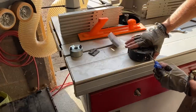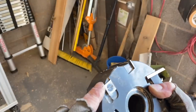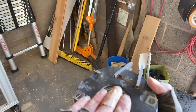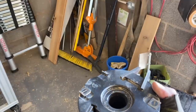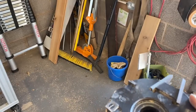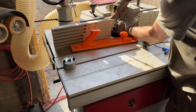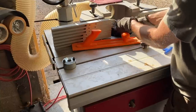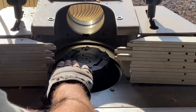These are the blanking plates. If you look closely, there's a cutter here on the top to give you a nice clean cut, and then there's a blade here which can also be replaced if it goes blunt. It also comes with a flush-fitting top bolt so you can do your tenon right over the top of it — that's how I do the tenons. It's almost like a single tenoner. It's quite slow doing it this way, but I don't have room for a tenoner. It's completely flush on the top — brilliant for tenoning or anything where the wood goes over the cutter.